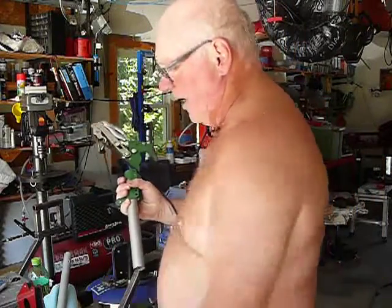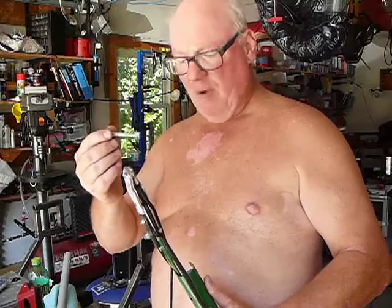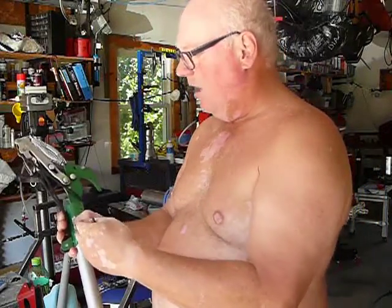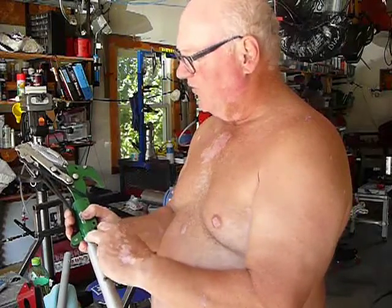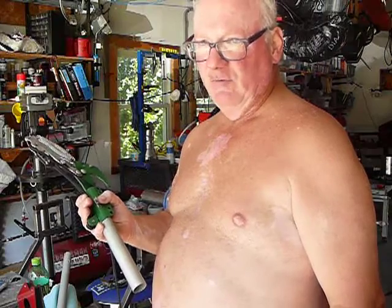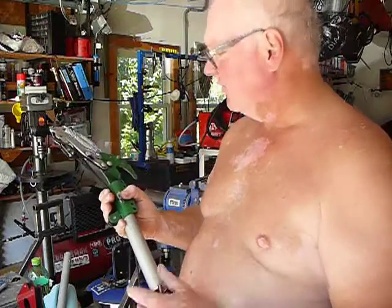It's going to connect by a 5/16" piece of all-thread, with washers and nuts — that's a piece of repurposed all-thread that I used and removed, and there was enough remaining that I already cut it down to the right size. One of the nuts is welded on, which works for me. So that's the whole project: I'm going to drill, then clean and weld these two together. It's going to be a little touchy — it's thin — so I'll use the MIG welder. I have argon gas, pure argon, which is for aluminum, and I'll decide if I'm going to change the gas out — I probably should — but I'll show you each step along the way.